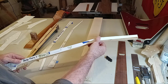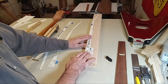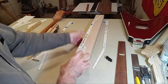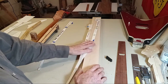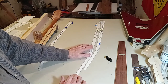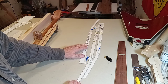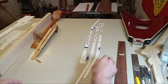So that's why if you get it right on paper, then when you lay your paper up on your piece of wood, because we're preparing to cut out this piece of maple to build a neck. And basically what you're going to be doing, if you got your pieces wider, I'm just going to let this go off the table. All right, let me show it this way. Just bear with me. This is the most efficient use of a board where you are roughing out three pieces. In other words, if you're building a three-piece neck where each piece is 3/4 of an inch thick, I have searched high and low to figure a more efficient way to rough that out. Let me see if that's on the camera. That looks great. I hope that makes sense.